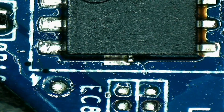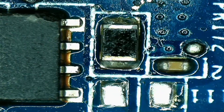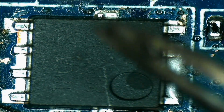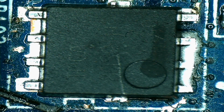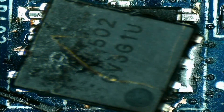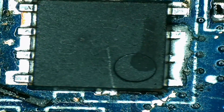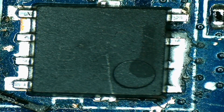Now that we're in the microscope, I'm going to show you what was wrong with this board. I'll put some pictures on screen too so you guys can see. This resistor was completely missing. And if you take a look, I've also replaced this MOSFET here — this MOSFET is for powering the CPU, and it was a completely wrong type of MOSFET too. As you can see, it's scratched on top and wasn't even soldered correctly. As Louis says, working in brain-off mode — I didn't even open a schematic for this one. I saw that it looked bad and crooked, so I reflowed and replaced the MOSFET.